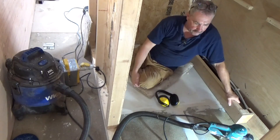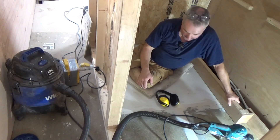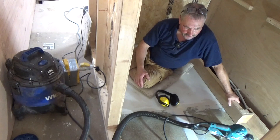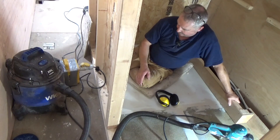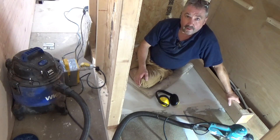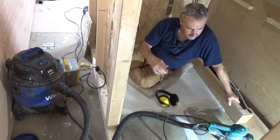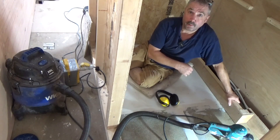That's all nicely blended in there, no high spots, so we shouldn't get any problems with that. Next thing is, you've got to caulk round these edges and what have you. I'll probably do that at the end of the day because you've got to let it set. Best idea is to put it round at the end of the day, then tomorrow come down after work and tank the lot - put the primer on and the tanking solution. And that should be that done then. Oh, there's tape to put round as well. We'll leave that for now, get the hoover out and have a look at this pump and getting that in.